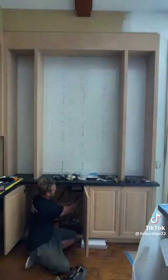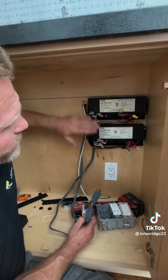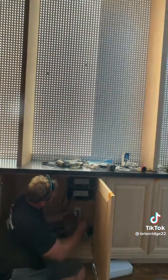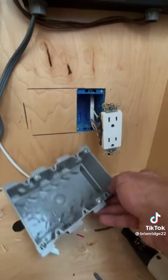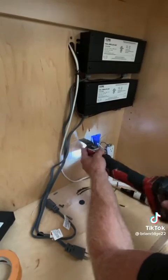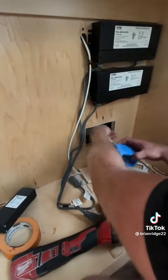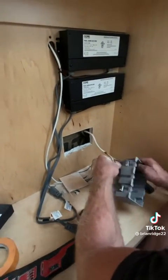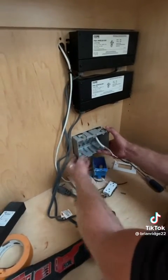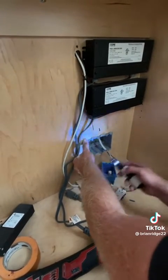Now I know I'm good — no shorts, no reverse polarity, nothing like that. I landed the home runs into the drivers and mounted them to the wall, separating the left side on one driver and the right side on the other. I removed the outlet, traced out my three-gang box, and now I'm going to cut it out with the multi-tool. After getting my box cut out, I pull the old box out and reinstall my three-gang box.